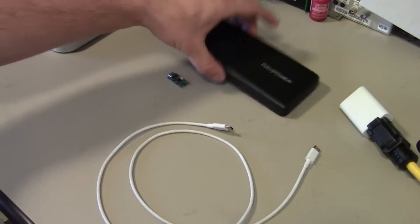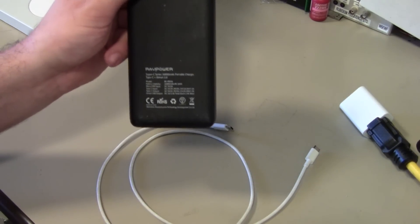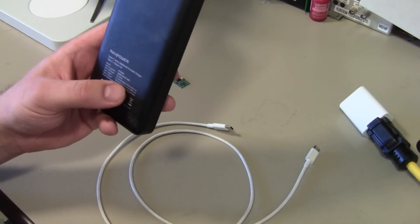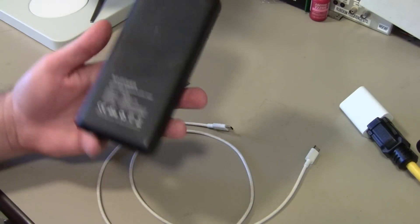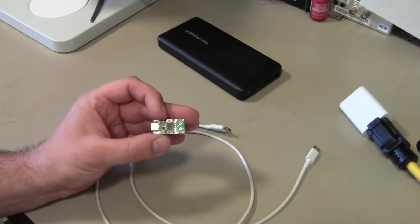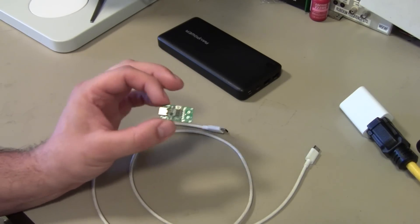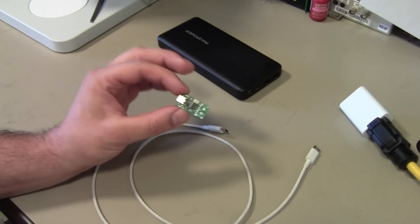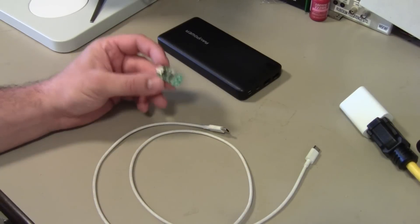But it also means that every USB-C device has some subset of power delivery options. So this is a relatively good USB battery pack that lists on it USB-C output 5, 9, 15, 20 volts. And so not only does this mean that it can charge your devices faster, but there's other possibilities. And so these little PCBs that you can find on eBay and Amazon are USB-C power delivery trigger boards, which mean that they negotiate — they speak that USB-C power delivery protocol to negotiate what voltage you want. So let's first look at this PCB and then I'll talk about how to get it to interact with these other devices.